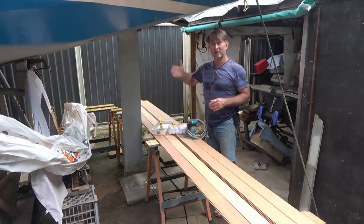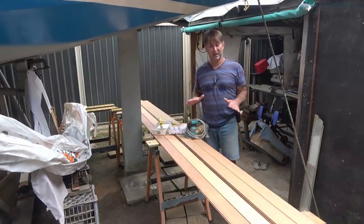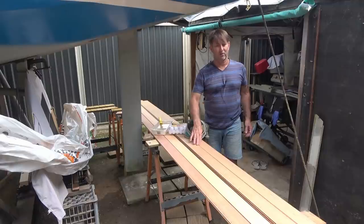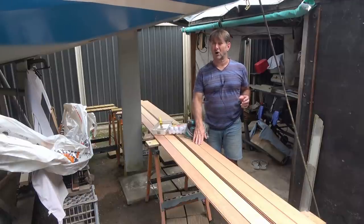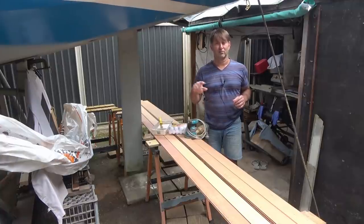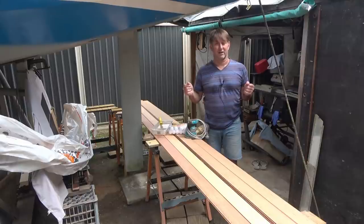When it comes to working out the lengths, I'll just cut them and then I'll just have the ends to touch up. And the thing that I really like about the idea of this is that it's looking like I'll be able to get a lot done quickly. I had another chat with the guy that supplied me with all of this. I was just concerned that this little tongue and groove profile, by the time I add that Dulux one-step paint, that it might make the joint a bit too tight. He sort of reassured me that this will actually soak up a lot of that paint, so it shouldn't leave a thick coating with that tongue and groove joint. And lastly, that if it is a bit thick, just a light sand with 120 grit will knock it off, and that should go together nicely.